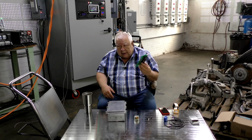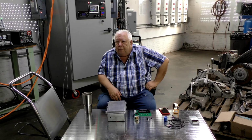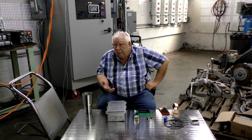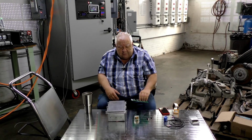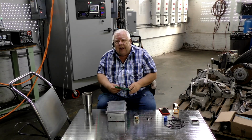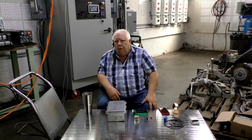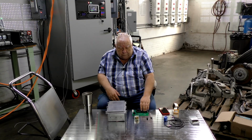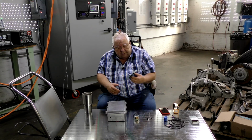There's also, in any device like this, some calibration. We have some calibration factors that you can change. It's pretty hairy to do so, and you change it to match what? A Fluke meter works for me, but you may want to get out an oscilloscope and get it really down to a gnat's ass. That's up to you. The device will do it. The calibration factors can be directly entered. I'm working on a little auto-cal thing where you can simply enter a meter reading and it'll seek that recursively by successive approximation. But that's what's going on there.